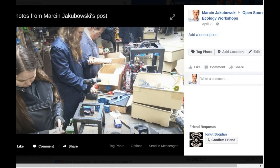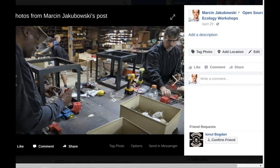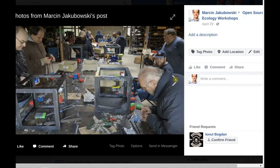It was about 40 Fahrenheit, like 5 or 10 Celsius. It was cold. There were definite issues, like the super glue would take much longer to dry. That was actually an issue. We have to do a very specific procedure for how you attach the magnets to the carriages, because if it's cold like yesterday, and people are attaching them one by one, it takes a long time. But there's a technique where you use a piece of metal to put them on and hold them with it, so you just let it go, don't have to hold it. Just little details all over the place about how the build should be made more effective.